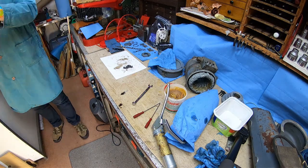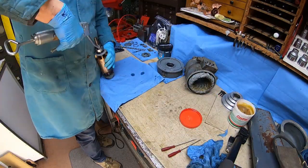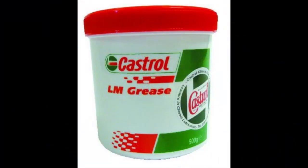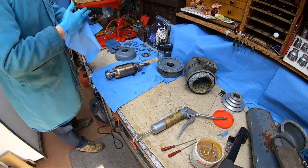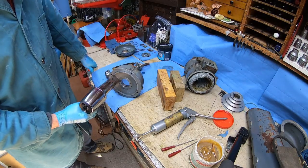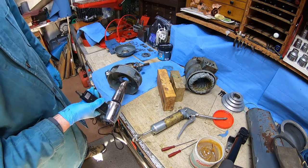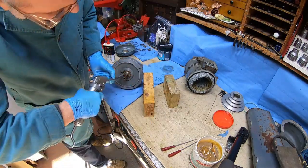What type of grease should we use to pack our motor bearings? First, look through the manual — it may specify which grease to use. My Alexander is old and the manual doesn't state a grease type for the motor bearings, so I normally use Castrol LM grease. I've used this in car and motorbike wheel bearings for over 40 years with no problems. How much grease do you place inside the bearing? Do not completely fill it — there's a good chance the bearing will run hot as it pushes all that extra grease around. Also, as the grease warms up it will expand, and with no room it will ooze out of any gap. I've seen figures from 30% to 75% full; I normally estimate just under 50%. If the manual gives an exact amount, follow the manual.